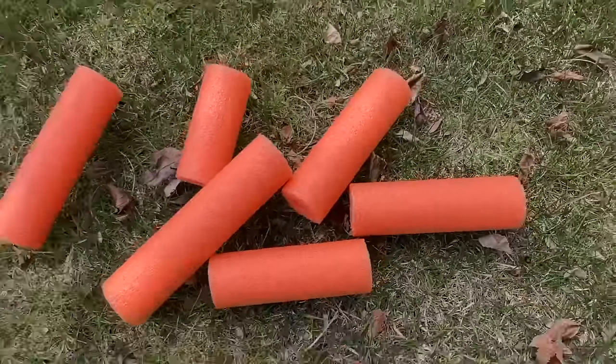We'll start by giving this old fence a quick sanding and then brush the dust off and we'll be ready for stenciling. Got a dense foam roller. Offload the roller so there won't be too much paint. When you're stenciling, try to use a nice even pressure. And now you can remove the stencil. Randomly place your next stencil and just continue.